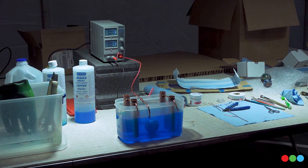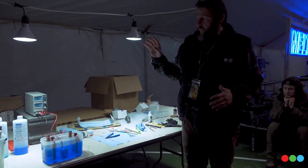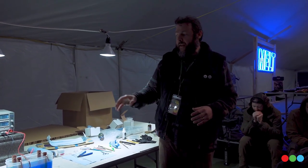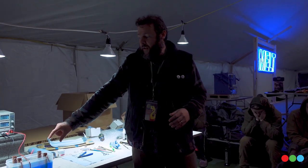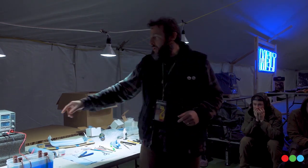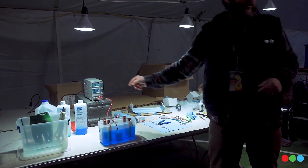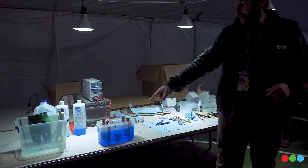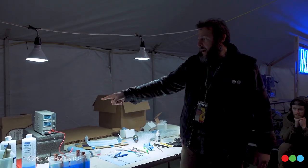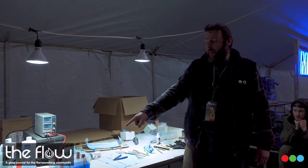Eventually, this is gonna turn up to like 0.01 amps, 0.02 amps. Now, if you looked it up on the computer, like how many amps to run for a certain size piece that you're doing, they would say, take the square inches of surface that you're trying to electroform and do 0.10 amp per square inch. Well, if I guesstimated that this was, say, even 2.5 square inches, and I put that up to 0.25, that would be growing that copper so fast.